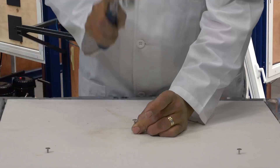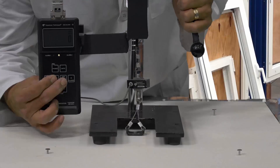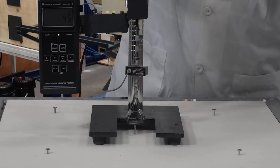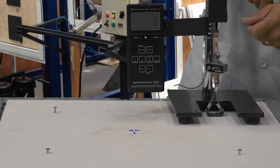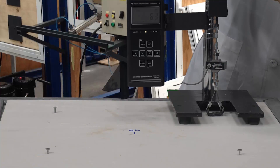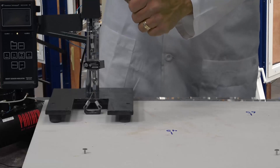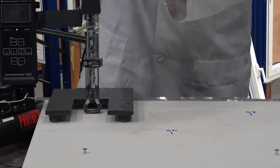Through an experiment entitled roofing nail pull force testing, it was found that many of the nails driven within a half of an inch of a prior nail hole seemed to hold with only a fraction of the strength of a nail driven into decking that has no nail hole around it. Of course if it is driven into or just to the edge of a prior nail hole there will be almost no adherence to the decking at all.